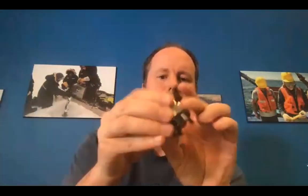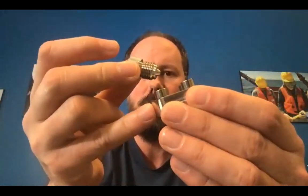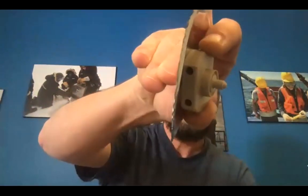Question from John Benest: does RBR offer post-deployment calibration providing an upper bound on system drift? Yes — we can absolutely do that, and Paros could also do it. Once the oil fitting is removed, an adapter mounts in the end allowing a deadweight tester or any other pressure controller to be connected for full calibration of the instrument.